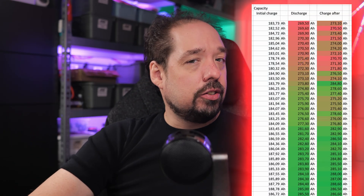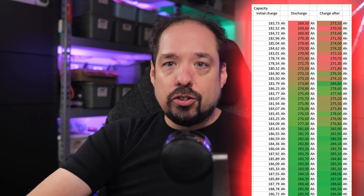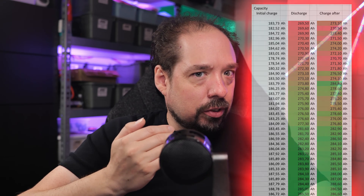Now, before you ask — yes, we can mix and match batteries or packs with varying capacities. You can parallel a pack with 100 amp-hour cells with a pack that has 280 amp-hour cells, both in a 16S series configuration, and that will work great. But that's when you parallel them as two packs. Inside of a pack you have 16 cells in series — this is where the capacity mismatch starts to matter. If you buy A-grade, you're basically guaranteed that all cells will do at least 280 amp-hours. But if you buy B-grade, as you can see from my Excel file, this is obviously not the case. Since I bought 70 cells and I'm going to be building four packs, I tested all of them and I'm going to group the most likely candidates together, so I know exactly how much capacity each pack will really have in series. So I don't actually lose much capacity overall, since a 290 amp-hour pack can work together with a 270 amp-hour pack in parallel — no problem.